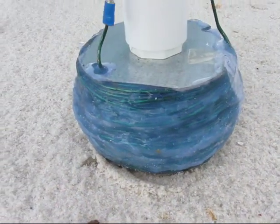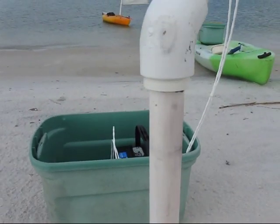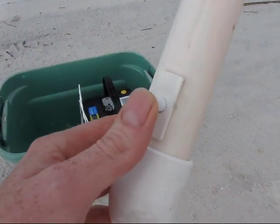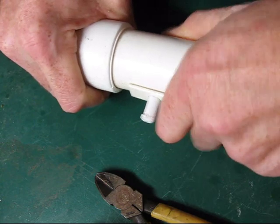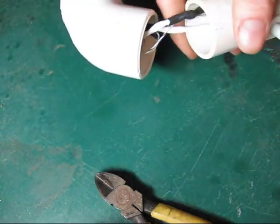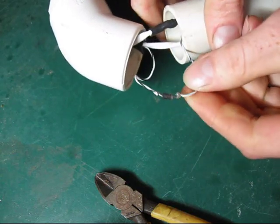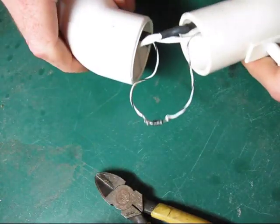The coil is now protected with a thick coating of silicone rubber, and we have a handle made from PVC pipe and a momentary switch that is only on when you press it in. To prevent damage to the switch contacts, the high voltage kickback spike seen earlier in the first hookup test is eliminated by adding a diode to the circuit.